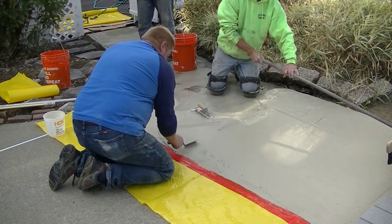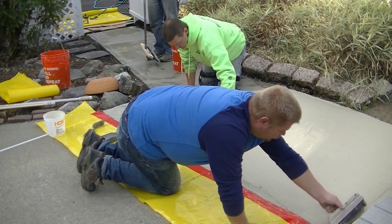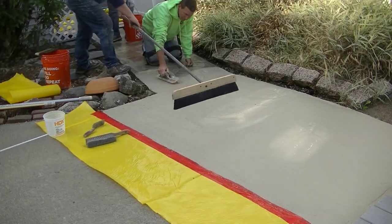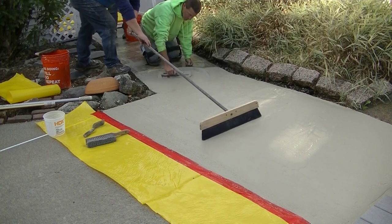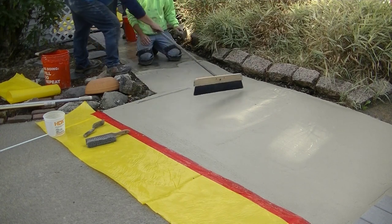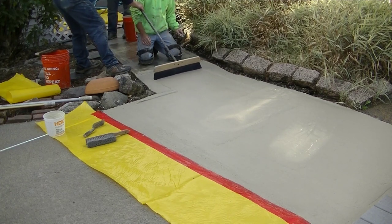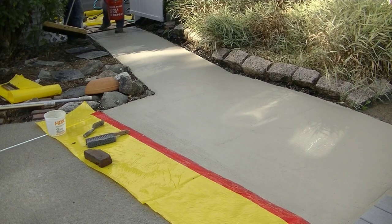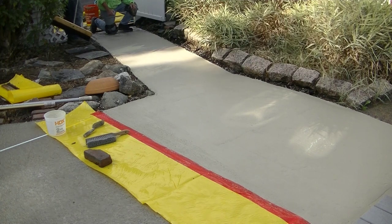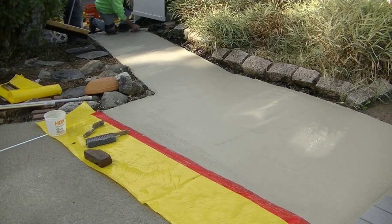But this video is going to tell you just how it held up after two years and two winters. We have winter here in Maine from around Thanksgiving until about the first of April, so we have about three and a half months of really cold, hard weather. We're just putting the broom on it to give it a little texture. When you trowel on an overlay mix like this, it's hard to get it to look really good — the trowel kind of chatters a little bit because of the tiny bits of aggregate in the overlay mix. So you drag the broom right over it and it gives it a nice, even broom texture, which is probably what the sidewalk had originally anyway.